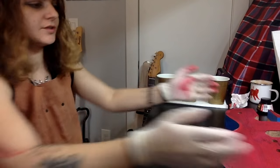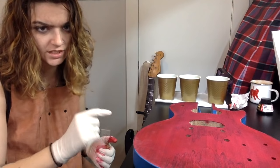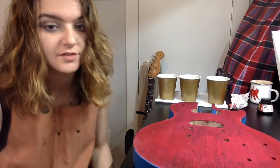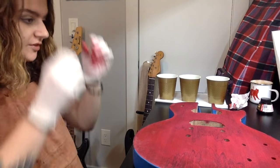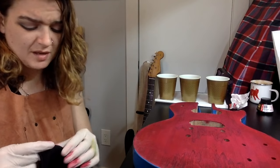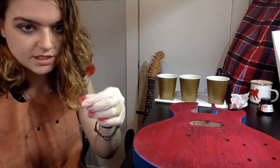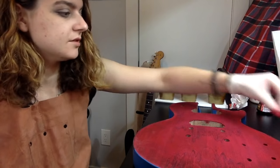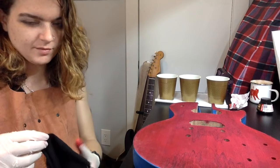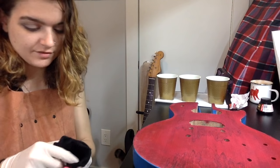To get the feather effect I want, you should definitely mask up the sides of your guitar. I'm actually going to be staining the back and sides red, but I don't want the black to run down otherwise I'd have to do black down the sides as well, which is not my preference. I've got three rags here cut from a t-shirt — you can use a paper towel. Try to fold your rag into a surface that you can get an even finish with.